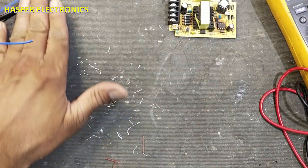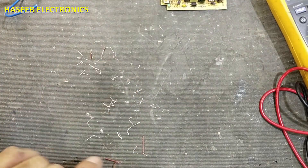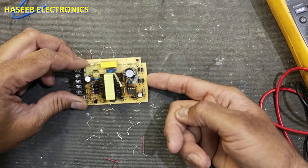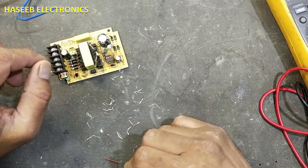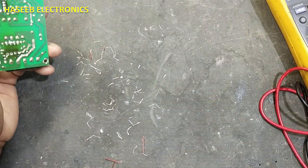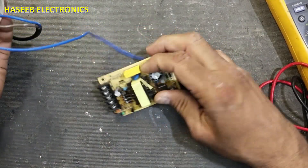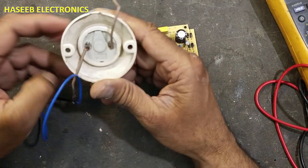These small electrical connectors and solder droplets are very dangerous. If you place a board here, they can make a short circuit — any conductor touching the board when we apply power will damage it. So we must take care of the cleanliness of the table. The table surface must be free from all conducting materials.